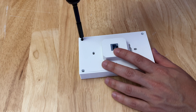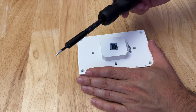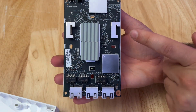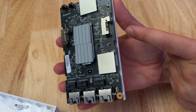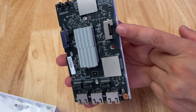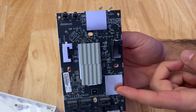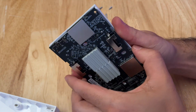We can take a look at the inside of the 655 because it appears to be a lot more simple to take apart. There are only four screws that need to be removed. And look — they're magnetic, unlike the EAP690E HD. With the last screw removed, this opens pretty easily. Here are the insides. I'm guessing one set of antenna must be for the 2 GHz band and the other for the 5 GHz band. Although this appears to look like one antenna, this must be two, since this unit has two antennae per band. And then we have the different controllers.